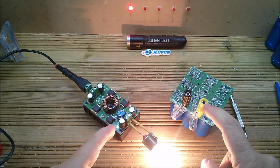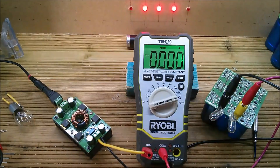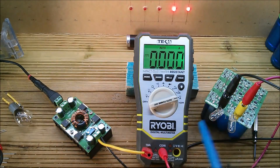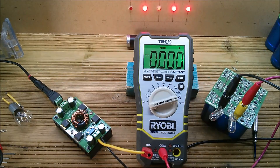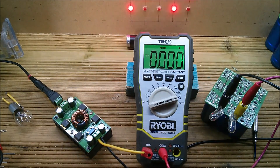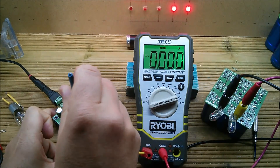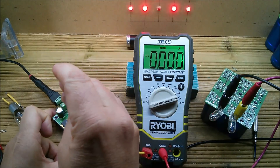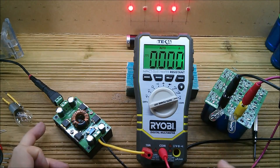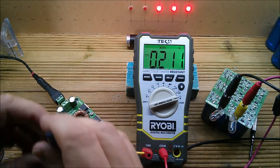Let's do something a bit spicy and charge this supercap module from here with no anti-back-feed diode — some power supplies say you must use one, but let's not bother. I've wired the output to the supercapacitor and put an ammeter in there as a concession — and also because it helped me reach with the wires. Let's turn this on. There's not much current; let me turn up the voltage. I don't know what I've done — the voltage was set to about 24 V but I've got no current. The problem was the current pot was too high and the power bank's three-amp limit was kicking in.